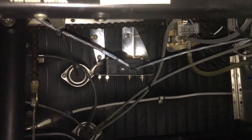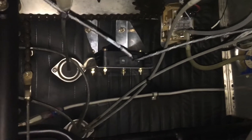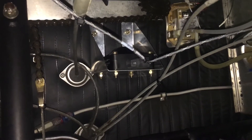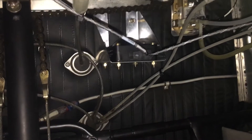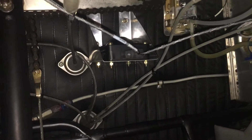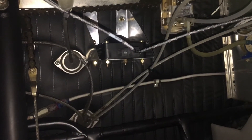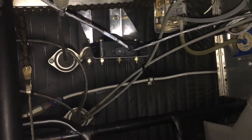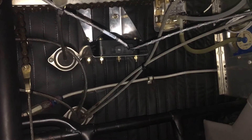The EMA has to be mounted to a rigid surface. There's mine - I had to make a bracket for it right up to the firewall. I'm not going to pull the cowling off, but there's a stiffener that goes across the firewall on the other side and it's bolted right through that, so that's plenty rigid. The requirement is something like 0.05 of an inch of movement maximum with 100 pounds of force on it.